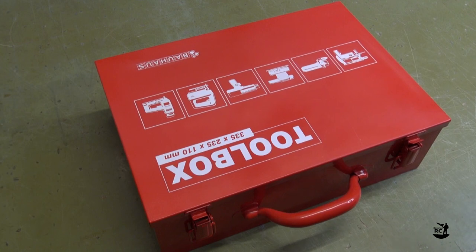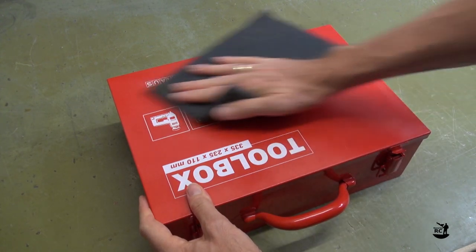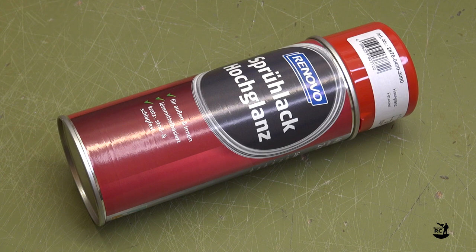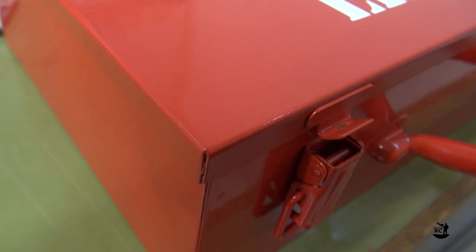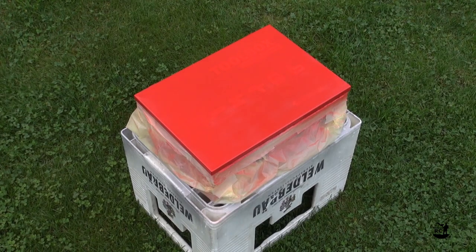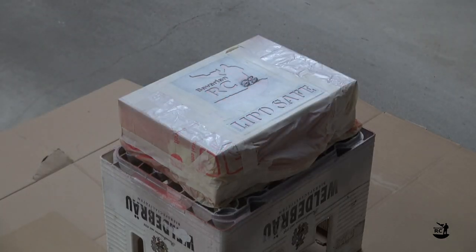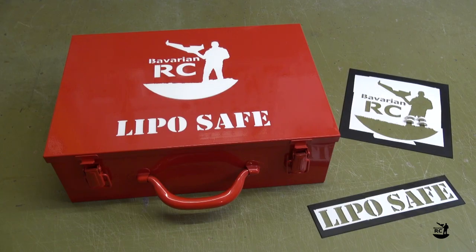In the next step, I am painting the lid of the box — this is fully optional. In my case, I decided to put my logo and some text on the lid. Before painting, I recommend using Scotch-Brite to prepare the surface. Use a synthetic resin spray paint in RAL 3000 Red — it is slightly darker than the red of the original box, but as we are painting the complete lid, the difference isn't really noticeable. Apply several very thin layers of paint until the white elements are no longer visible, then let the paint dry for at least 24 hours — the longer, the better. I used my 3D printer to create a stencil for spraying my logo and the LiPoSafe text onto the lid. The link to the STL file for the stencil is in the description below. That completes the build of the LiPoSafe.